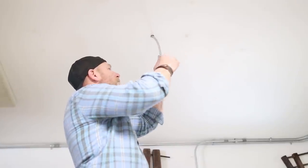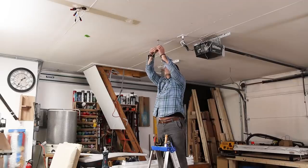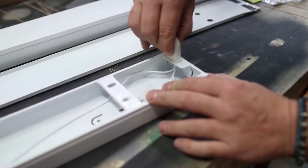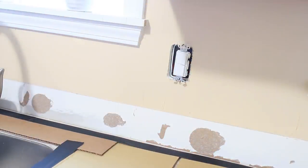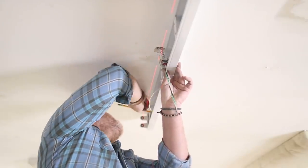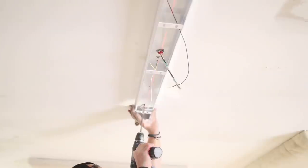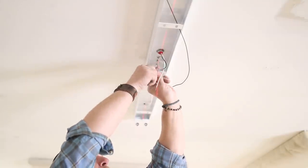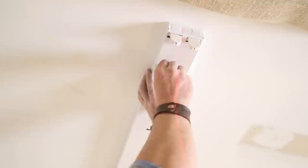So now I have all the whips hanging in the shop, and it's time to start stripping all the wires to get them ready to connect the light fixtures. And again, make sure that the power is off. Electrical is nothing to mess around with — believe it or not, this is not the first time this has happened to me. So this time I made sure that the power was off, and marked where the screws needed to be on the lights so that they would hit the joists. These lights are very thin metal and you can drill right through them with a wood screw. Next I stripped all the wires and connected the green to green — the ground, the white to white — the neutral, and finally black to black — the load. Replace the cover with the provided pins and install the Parmita replacement bulbs.